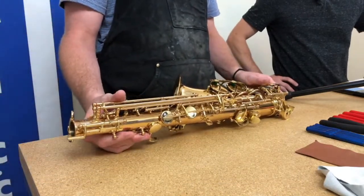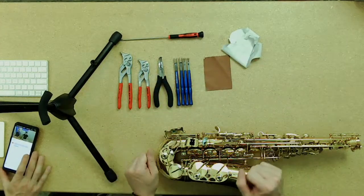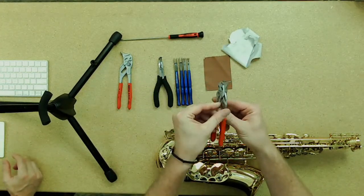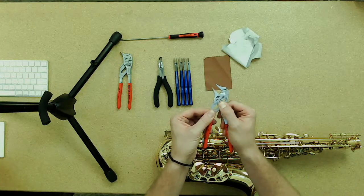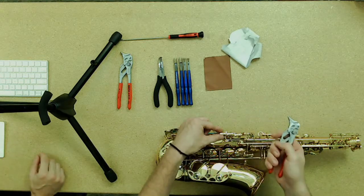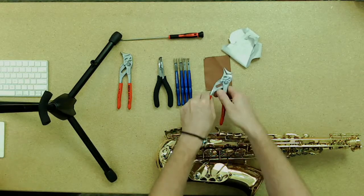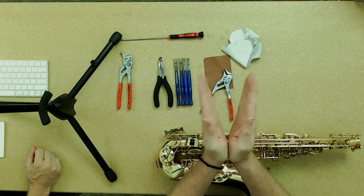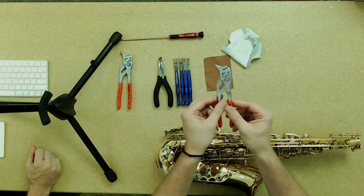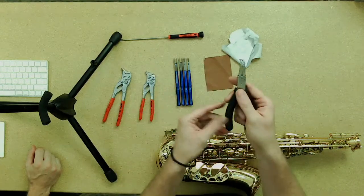Let's talk about some of the tools I'm going to use. The first being these Knipex duckbill pliers. I like them because the jaws are adjustable — I can grab a variety of different sized things in a variety of different areas, like grabbing the sides of key touches. I also like them because they are parallel, giving a lot more contact when something is parallel versus grabbing with a normal traditional pair of pliers. I have both the large and the small. I also have a pair of Staub specialty pliers with a hook, which I can actually get under key touches and bend it that way.